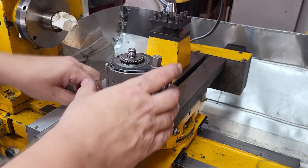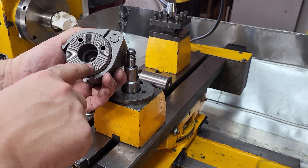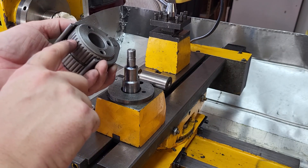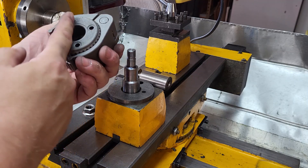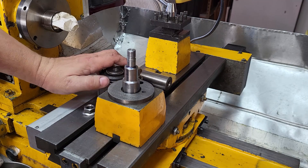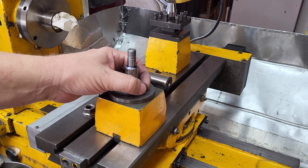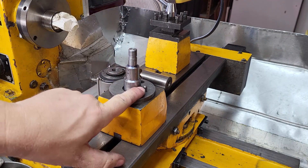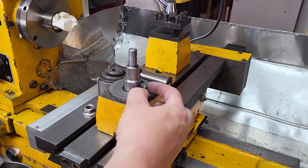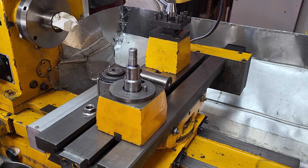This is the Peewee Tools version of the multi-fix. They have locating holes - in the original multi-fix there's just one, but in the Peewee Tools version the nubbins are all nine degrees apart with additional holes three degrees offset, so you can use the locating pin to get yourself to three-degree accuracy. What I did wrong originally was when I reamed out the six millimeter locating pin hole there was some wiggle, so I can't actually use the locating pin to line up the post when I mount it. I have to line up the face of the chuck instead, which is a little annoying, so I'm going to have a go at redoing this hole farther around to get it in the right position and make that pin useful. That's the project for today.